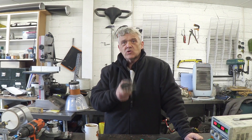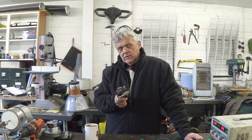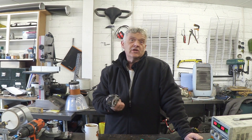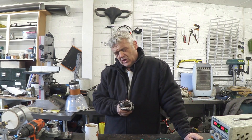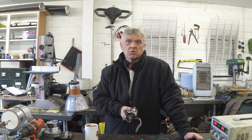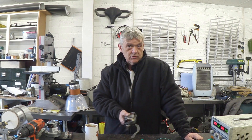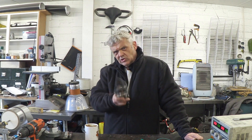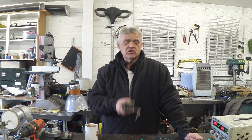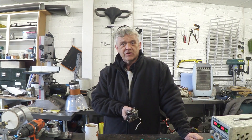If you spin these slowly they won't generate much; if you spin them quickly they generate an awful lot. Because it's series wound, the field current and the armature current are dependent on each other. Run it at very high resistance and you get low current flow, a very weak field, so it won't generate much. Low resistance means high current flow, strong field, generates a lot. So the velocity at which you can turn these is really key to how much they can generate.